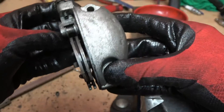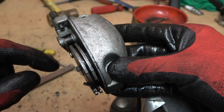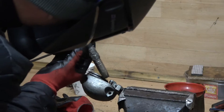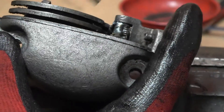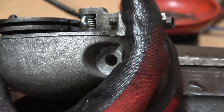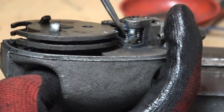What we can do now is quickly put some welds in there and then we've repaired this box. We don't need a ton of weld - just a couple of little tags. With just a couple of welds from the top part of the arm and the bottom part onto the thread, we now have secured this tube inside.